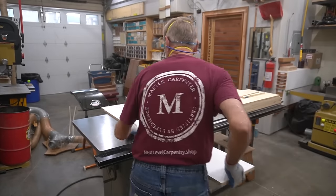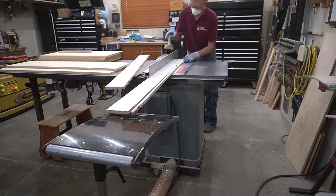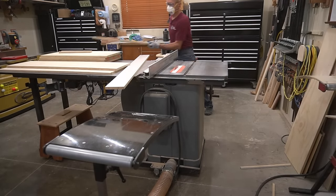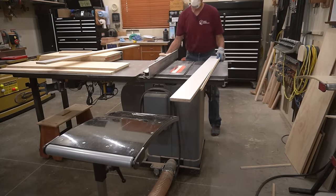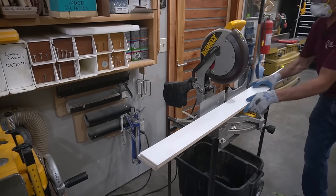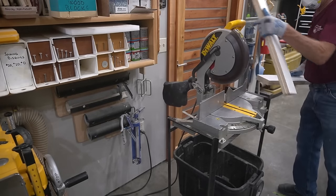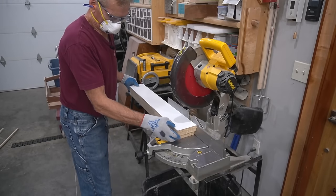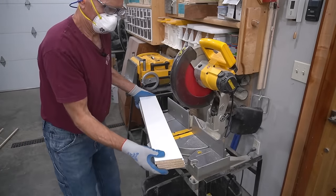While the table saw and roller stands are set up, I rip a piece of scrap five-eighths inch thick melamine-faced particle board about five feet long into two strips about four inches wide that I'll use for the stopped dado routing jig. Next, I chop these two rips about in half and cut four pieces to equal but arbitrary length a little over two feet long that I'll turn into a simple but very accurate dado routing fixture in a few minutes.